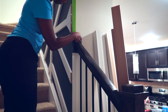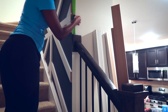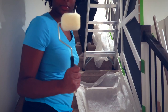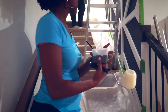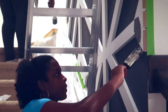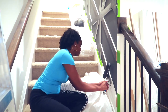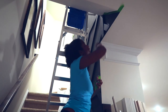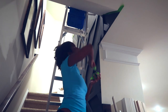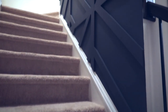To prep for final painting, I taped off the sides of the walls I didn't want to get darker paint on, since I'd be painting all the edges of the boards. I started with a small roller, but using a hand brush in a small bucket worked better since the small roller gave a fuzzy finish. We also used the larger roller for consistent coverage throughout. Then I removed the tape while the paint was still slightly wet to identify any touch-up areas, and for the most part we were good.